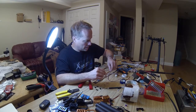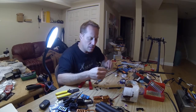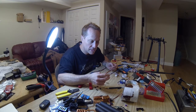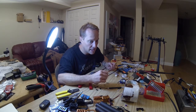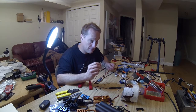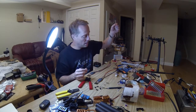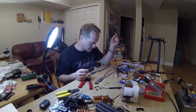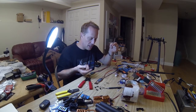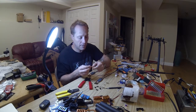So how do you make these wires longer? Well, you can buy servo extenders — they're a little bit expensive, anywhere from $8 to $12 each. If you're building a hexacopter that's six of them, and an octocopter that's eight, so the price can add up very quickly. What I've done is I've just bought 14 feet of this wire and I'm using 28 inches per electronic speed control. I desoldered the old leads and soldered on my own, and now I have to build the plugs.